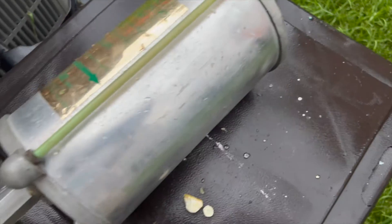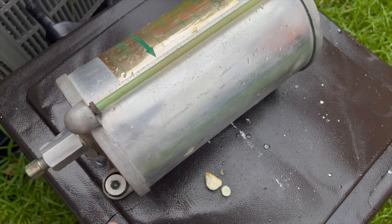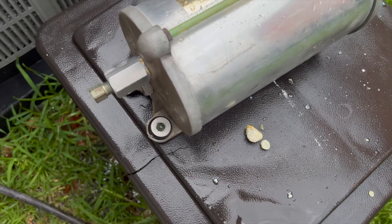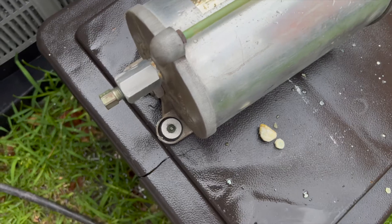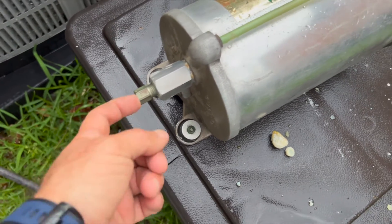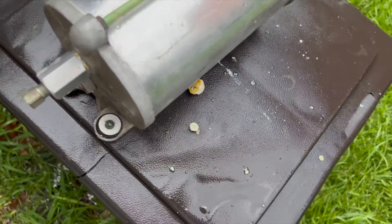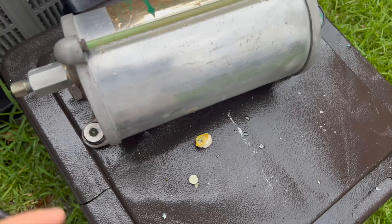He was only getting 60 pounds of pressure and I couldn't bleed anything out. Starting from the basics, I took the hose off the valve and nothing was coming out. With 60 pounds of pressure and no flow, that told me there was a blockage. I used a hammer and an allen key to bang the hole through there to get all the crap out — look at the size of the chunks. Huge calcium or ethylene glycol deposits coming out of it.